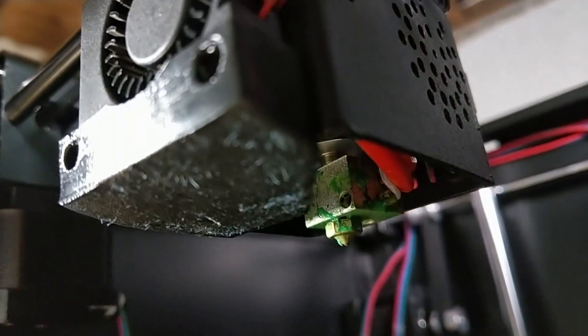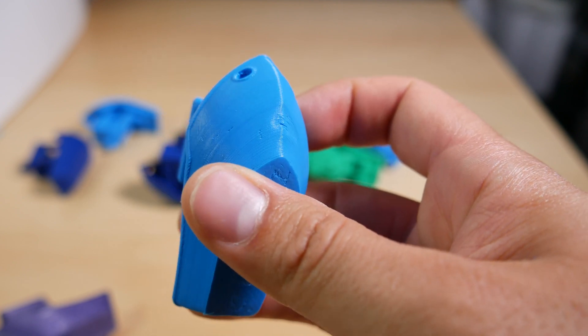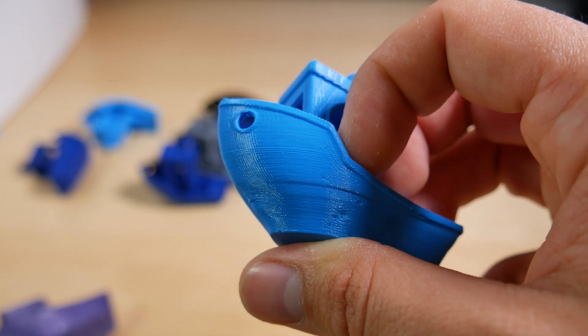Aside from the print quality issues with the drivers and failing cooling fan, the only other issue was more of a design flaw: the cooling duct for print cooling isn't really that good. The opening at the end is really small and far away from the print itself, resulting in severely under-cooled prints — which is pretty important when printing with PLA. ABS and PETG not so much, but PLA really requires active cooling. All it needs is a bit of a redesign, and if I end up redesigning one you can probably find it linked in the description. Other than that and the small issues with the drivers, this printer is pretty good.